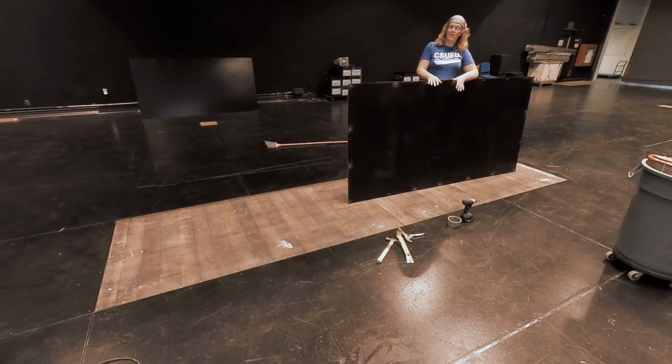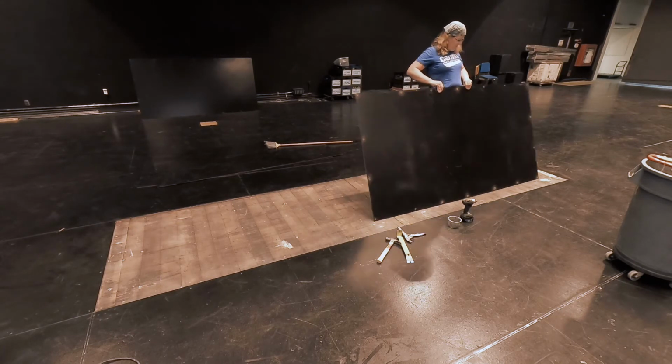If I paint them in place, I have to install them, I have to put them in place, and then I paint them, and each coat of paint has to have an hour, hour and a half, 2 hours before people can walk on it. 3 coats of paint, a primer, and 2 coats of Mann Brothers floor paint, and suddenly I've got the space down for 6 hours or so. And just got to see what time and space you have. All right.